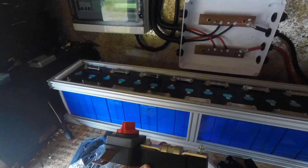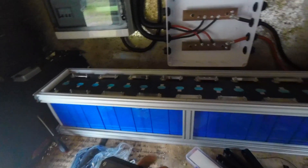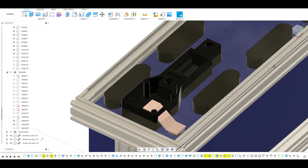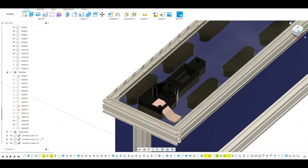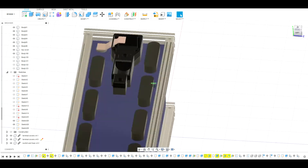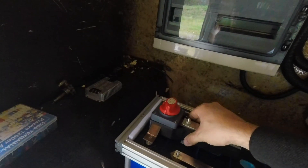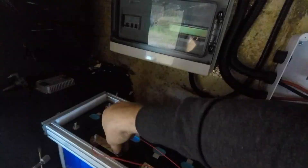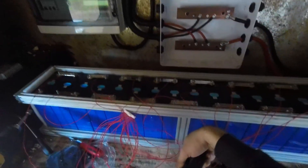This is going through an apparently 400-amp breaker or isolator. This is another piece that I 3D modeled and printed — it's in PETG, along with all of these battery covers. This block just holds the fuse and the main positive, and then this goes onto the main positive of the battery, which fits just about there. Main positive.